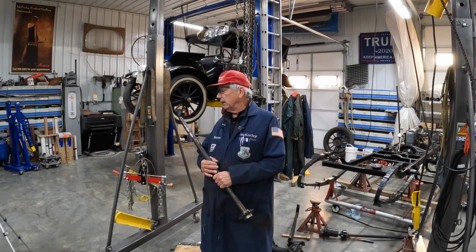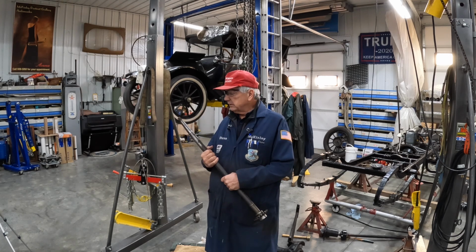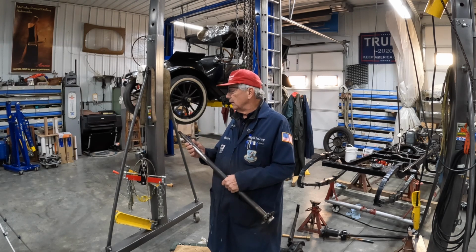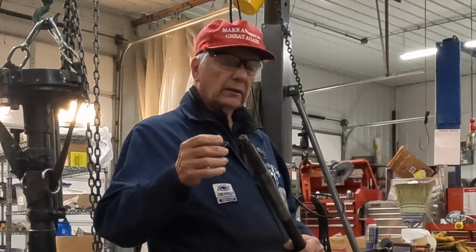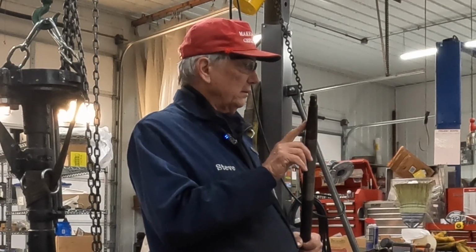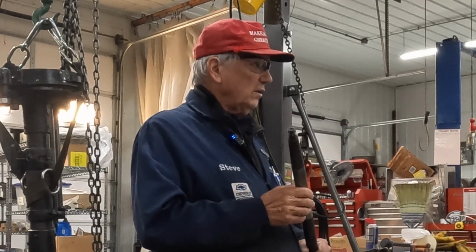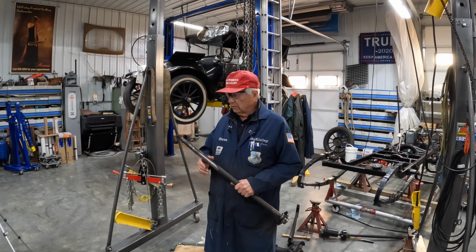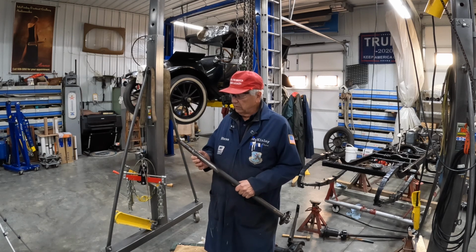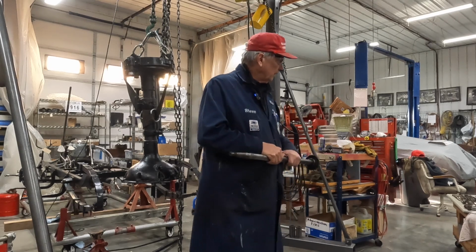So, anyway, we've got this axle that's too long. The keyway was damaged from wear and abuse. I'm trying now to cut this taper on the old shaft. It's too long. We're going to cut it down and try to recover the keyway with the new material that we're going to be exposing by shortening it. We're going to move the keyway in somewhat. So let's head over to the lathe next and start on that.